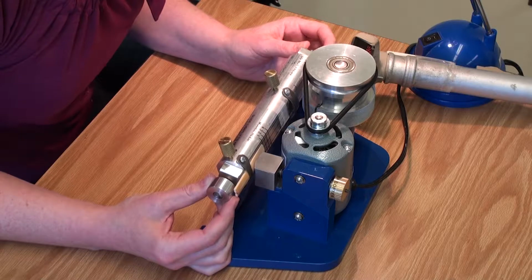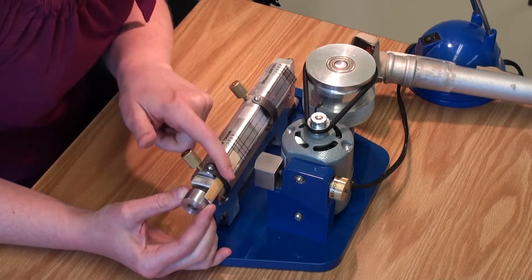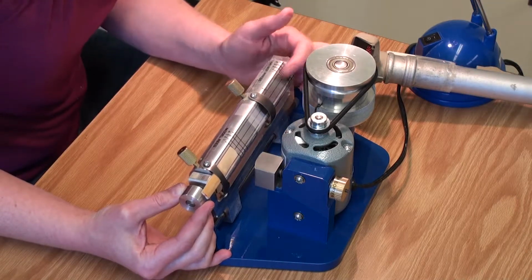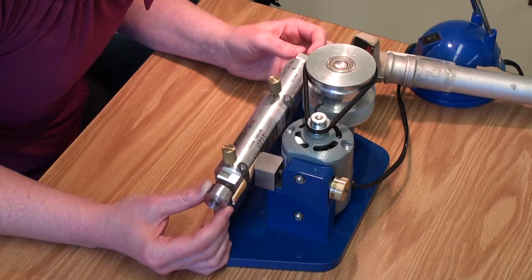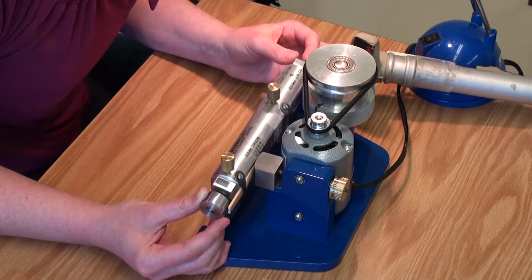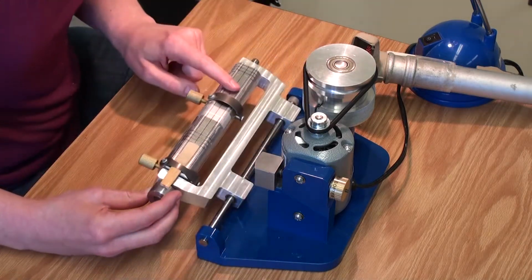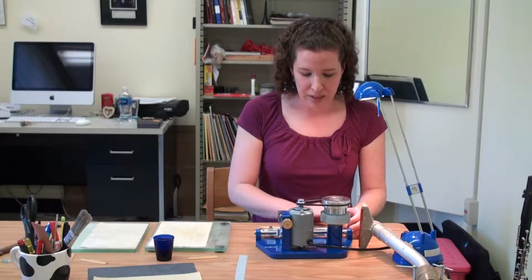So what you're going to do eventually is make smooth stripes down so that this follows the contours of your model reed and transfers it over here to the blank on this side. So as you're basically teaching the machine, this is the shape of the reed on this side. You can start in the center so that you're cutting away everything on the blank that doesn't match the model reed on this side.